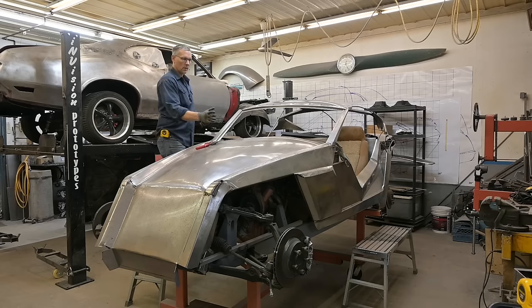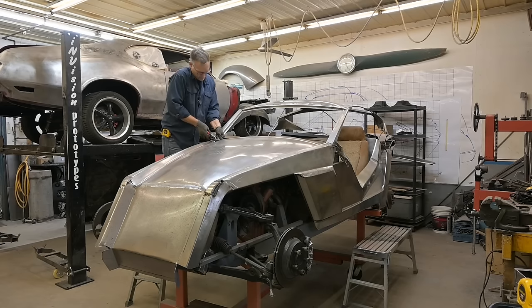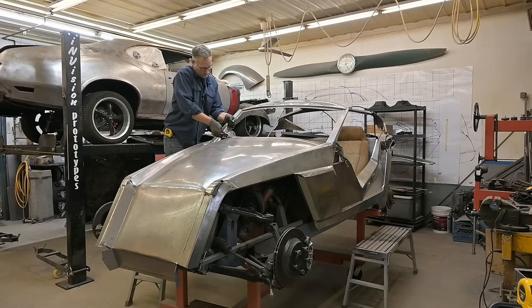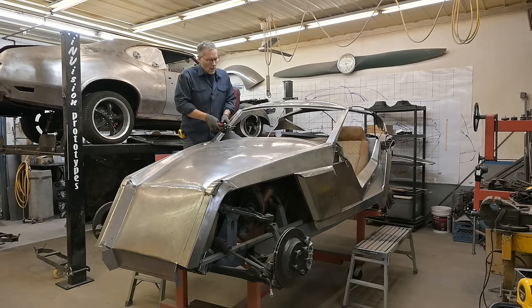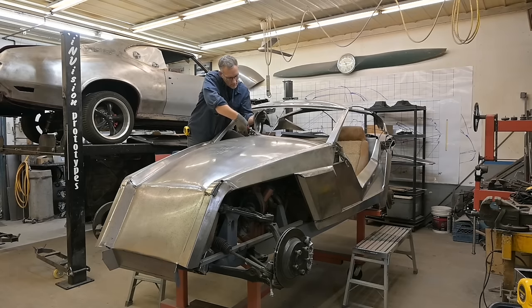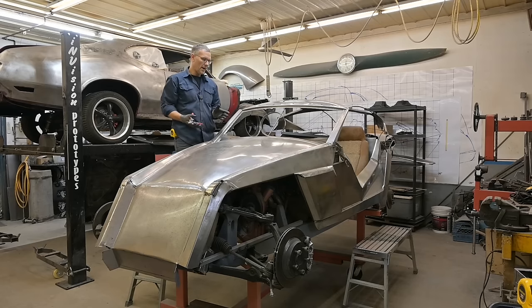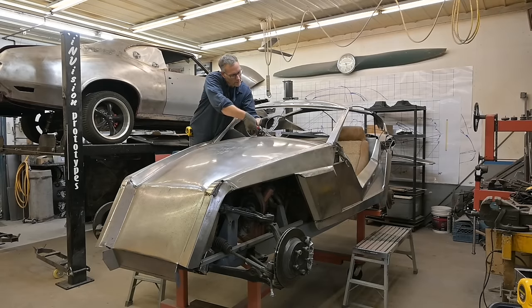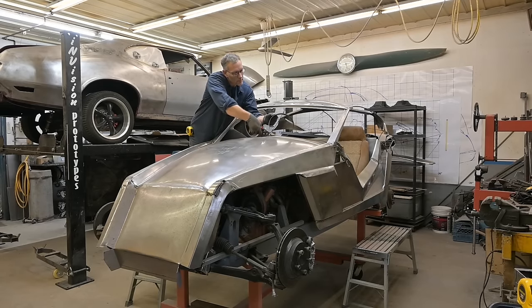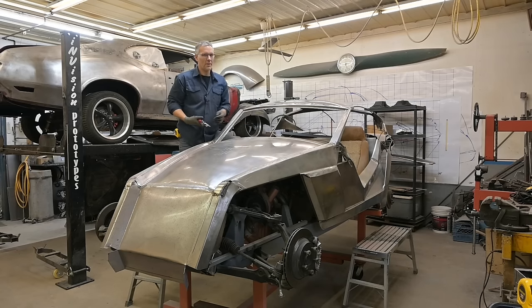So I spaced out all of my lines based on the 3/4 inch tape, the 1/2 inch tape for the flange, and then ran Sharpie. The hood skin is 20 gauge. It's not too bad to cut it by hand. I thought I locked those wheels.